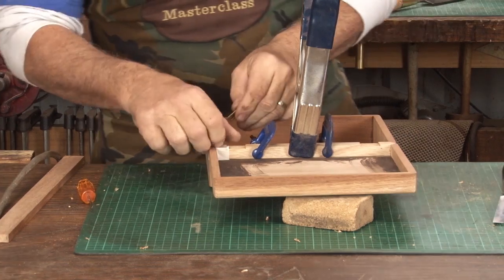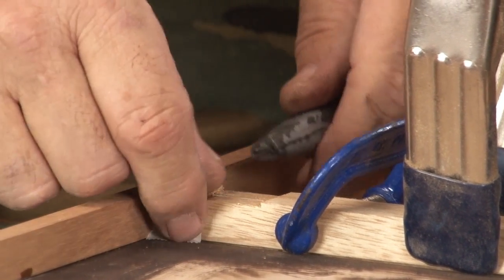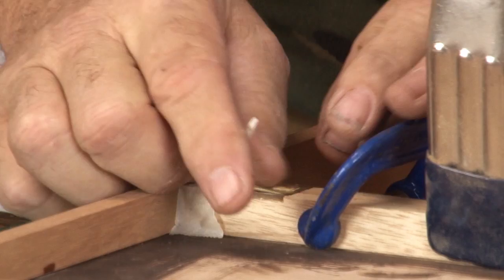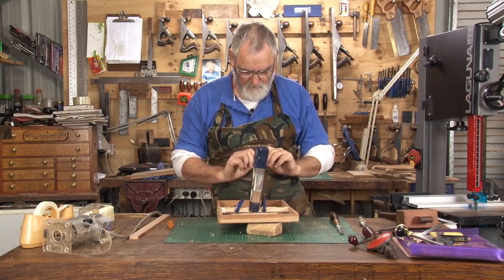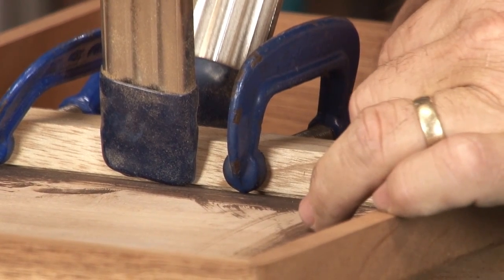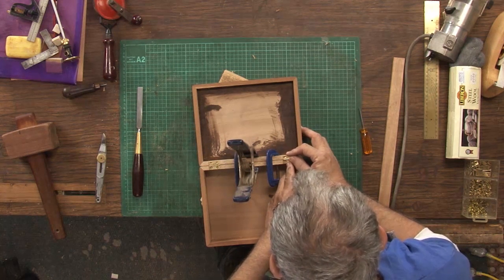Now right goes with right. That's the one we had the drama with. Let's cut that out of the way. Shouldn't be too much drama. This is the left. Okay, so again, we've got the barrel centralised up between where the two joins. We've got a slight gap in there to allow the hinge to close so we don't get a spring.